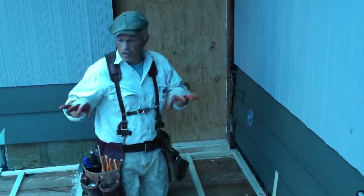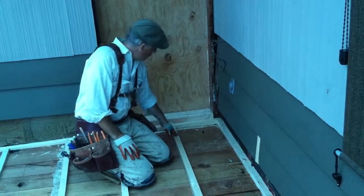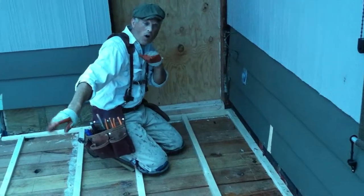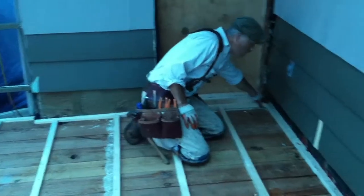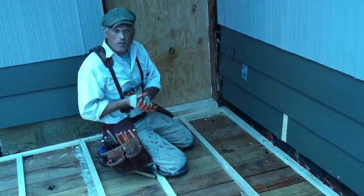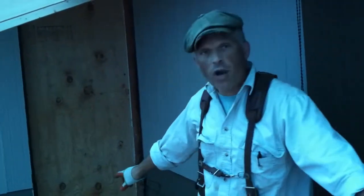Okay, so here we are on a deck that we're working on, and I just want to show you that we've had to manufacture these wedge-shaped pieces in order to get our slope a little bit better than it was before. So what we did was we set up a string line at 1.5 inches here, down to nothing there, 1.5 inches here, down to nothing down there, and we got our measurements, and we brought an as-built into the shop, and I'm going to show you an easy way to cut these long wedge-shaped strips in the shop quickly and easily.